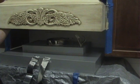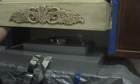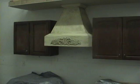The final step is to install the blower motor and insert. We'll have our electrician hook up our electrical wires, we'll connect our ductwork, and we'll be ready to screw it in place. We'll lift the unit into place and fasten with the 4 screws provided.